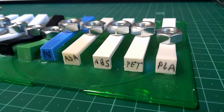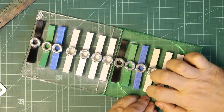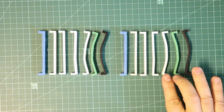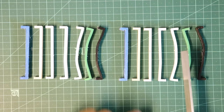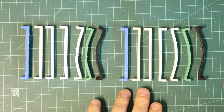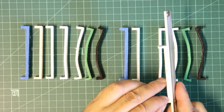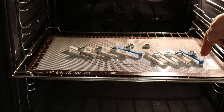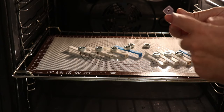This is the situation of the first 7 test probes, and the other half looks very similar. All three types of PLA failed almost equally. Now here starts the interesting part — PETG: I can definitely see the deformation, and I can illustrate it with a caliper. ABS, ASA and nylon are still in the game — completely straight, I cannot see any deformation on them. Also included is one test probe of a slightly different shape, which is resin-printed with an SLA printer.